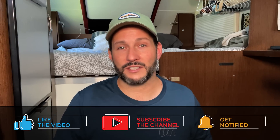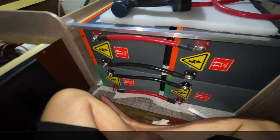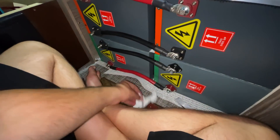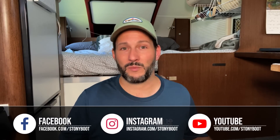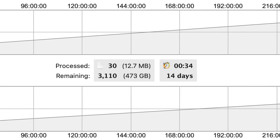What I've done now is added two more 300 amp hour lithium batteries for a total of 1200 amp hours, which for us is a ridiculous amount of power but it's been great. We can run pretty much everything we want for an entire week. The biggest demand is keeping my computers running all the time as we make videos and other content — I use the computer all day long and then let it run overnight to do uploads.